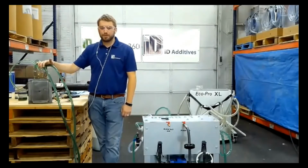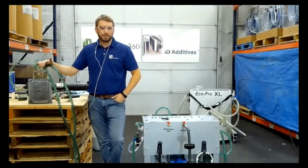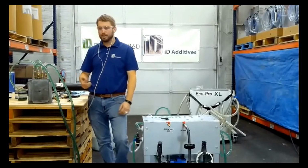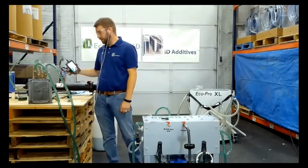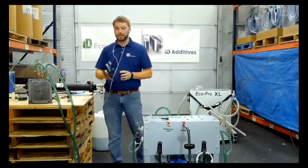You know, it affects part performance, and with everybody going to conformal cooling now versus straight through lines, you can't just simply drill out. And a lot of times guys will take their shop air, shoot through one of the circuits and say, oh, I've achieved flow. Again, that's why it's important. When people tell me they don't have any issues with their cooling lines or they're perfectly clean, I ask if I can scope.